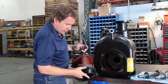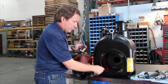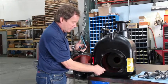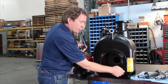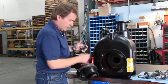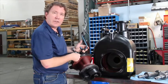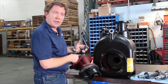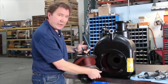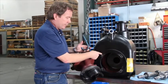The distance between the face of the impeller and the wear plate is established on the PL series pump by the position of these socket head screws. On your T-Series pump, there'll be some washers installed between the back of the rotating assembly and the pump. These are critical to maintain the impeller clearance. If you assemble the rotating assembly and bolt it in place and the impeller doesn't turn, there's a good chance you don't have enough clearance between the impeller and the back of the pump.